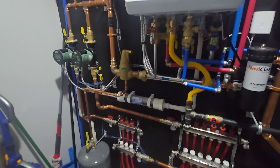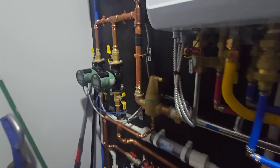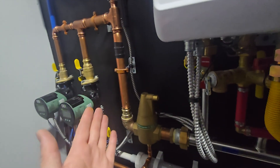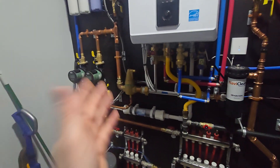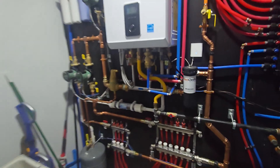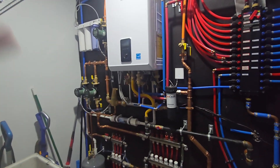That's also where you want to have your fill valve. Because if you think about it, with the secondary pump pulling at the lowest pressure point, if you're filling the water there, the water is going to naturally fill at that point because you're putting high pressure into a low pressure — that's naturally going to be the best place to fill. It doesn't have to be there and you may have a system that's not set up that way, but that is ideally the best place to put it.